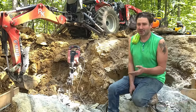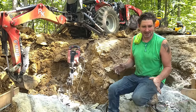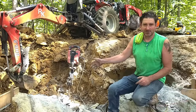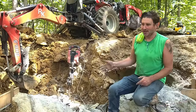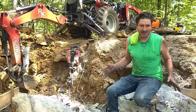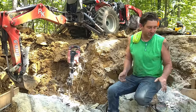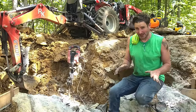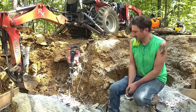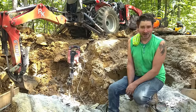if you're wondering why I waited till now to do this, because this wasn't my original plan, but as I thought about it last night, came back this morning, I was like, yeah, I'm going to remove the parts of the rock that are in the way of the footers so then I could continue the footers uninterrupted and then pour the concrete, put some pins into the rock before I pour, and then kind of tie them all together. I just think it'll be a lot easier doing that versus trying to chip away concrete blocks to get them to fit level on top of a rock. So, I don't know. I think it's a good plan making this change. But yeah, I should have done that while I had the breaker hammer on the track loader, but oh well, no one's perfect.